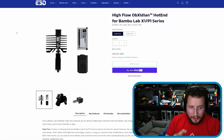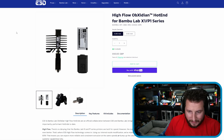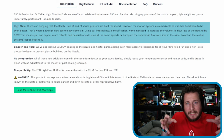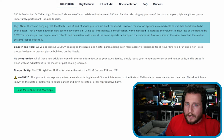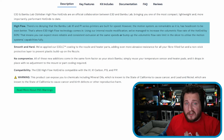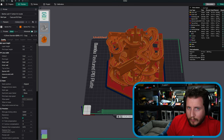The high-flow system works by splitting the filament into multiple channels, getting more heat where it matters faster, which allows you to print at higher speeds. Traditionally, the Bambu with generic PLA cannot actually top out the motion system — you need to run hotter or use a bigger nozzle. With this E3D nozzle, we've easily hit 30 to 35 cubic millimeters per second, up from the stock 12.